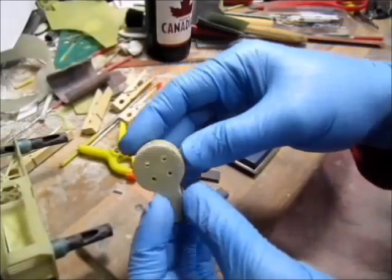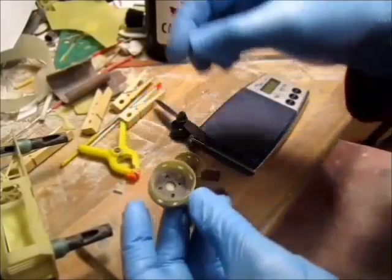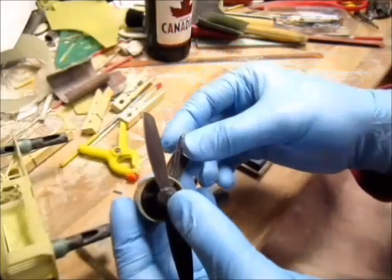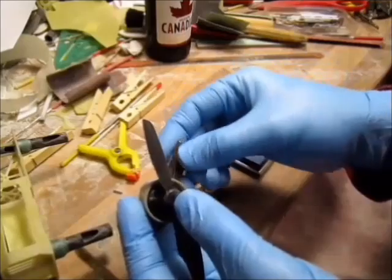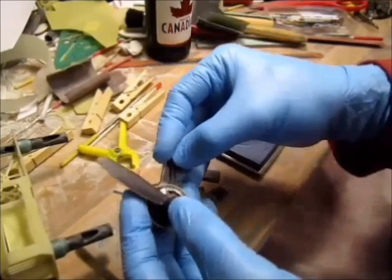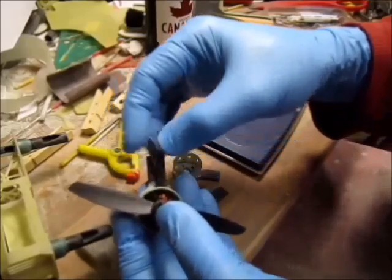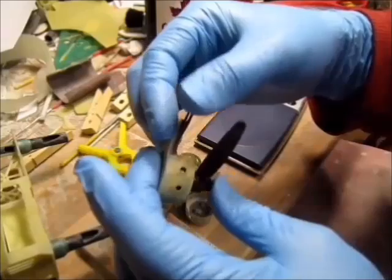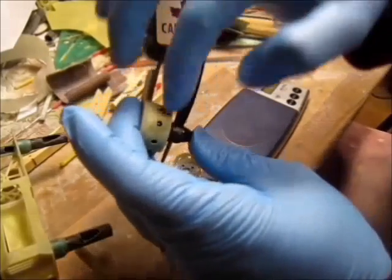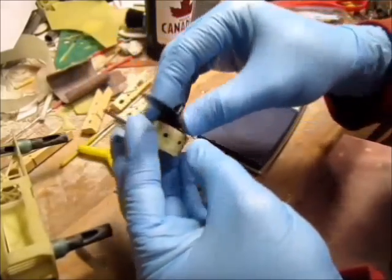Got the motor mounts done, glue it on. I enlarged the holes into an oval shape a bit because it's a bit tight here. On the motor I have only a millimeter and a half roughly each side, so I want to make sure I center the motor into the housing for the bell not to touch in there. Drill the holes a bit more for cooling, and I know the first time I will have to clean the dirt from there inside, I will start cursing badly.